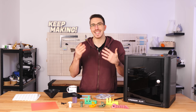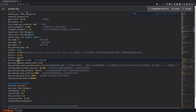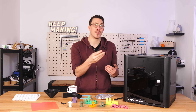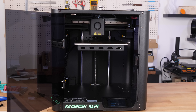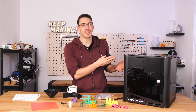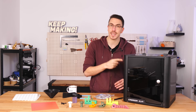You'll probably need that web interface — or at least it's the easiest way — to change pressure advance settings via the config files. The printer comes pre-loaded with a pressure advance line test, which is always nice to see. Also, the input shaper calibration is loud — I'm talking 69 decibels loud. Being all-metal with powerful stepper motors, expect significant noise.